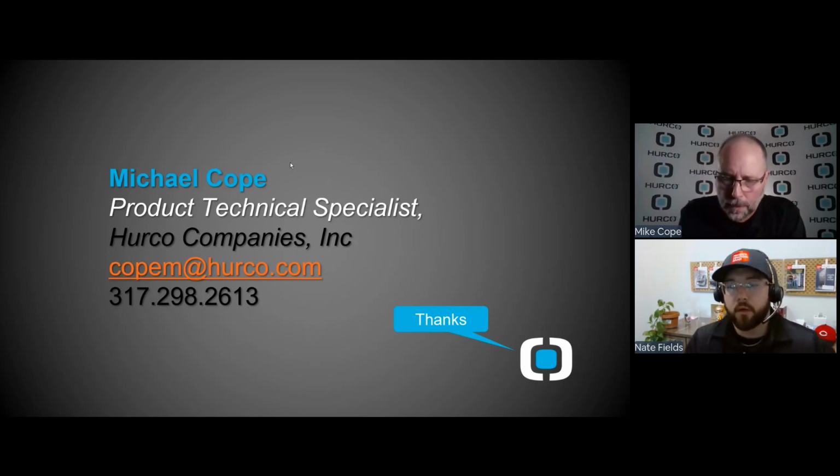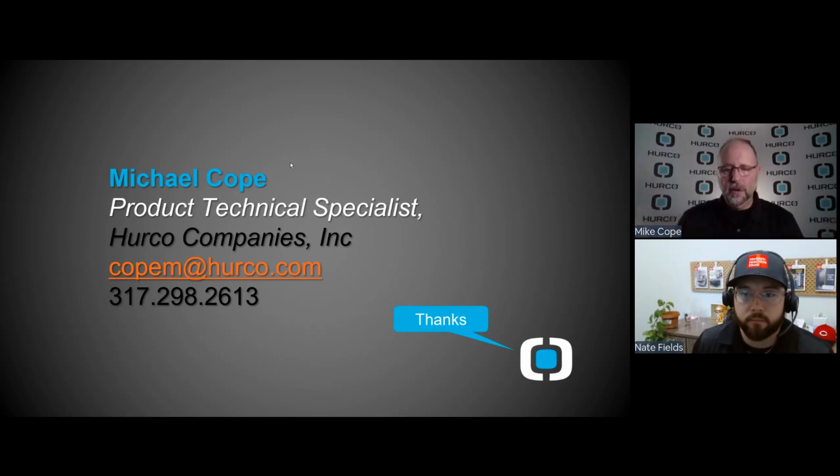Awesome. Next one is, if you had to pick one, which 5-axis machine configuration would you say is the most versatile for a job shop environment? Probably the cantilever or universal style. Again, we've got that very large table to hold a variety of work or fixturing options. And because it's a B-axis tilt, we're able to reduce the length of our tools and get a little more traditional on our machining capabilities there. So I would say that.